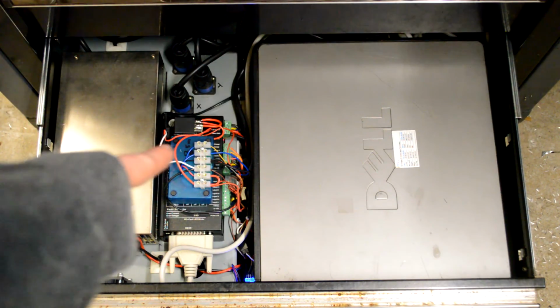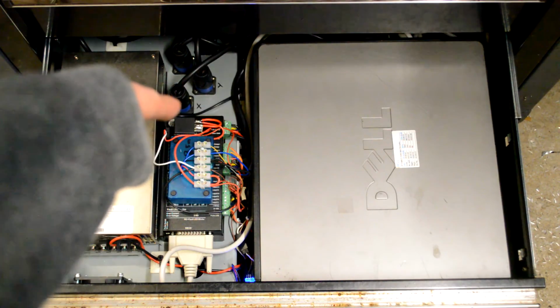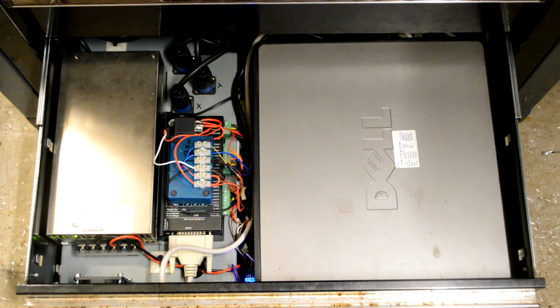So that box on top there, the little Jiffy box with the relay next to it, that's the spindle control and the coolant control. So the relay is just for the coolant. That drives straight off the Leadshine. I believe there's a transistor switch in there as well. Can't quite recall. Pretty sure there's a transistor switch. And there's also an Arduino in there that actually interfaces to the spindle. We'll come back to that later, which was a huge task though, but the spindle does work in the end off the Leadshine VFD driver, so I'm quite happy with that.